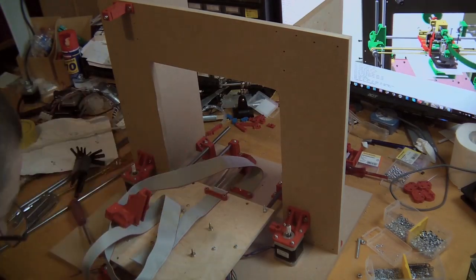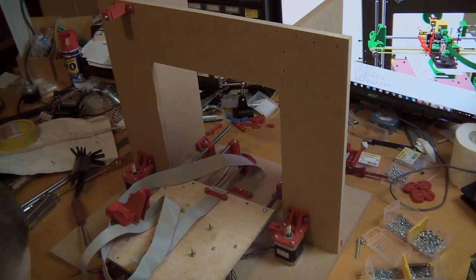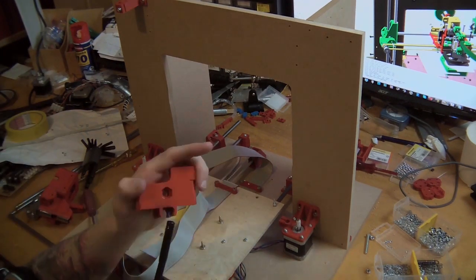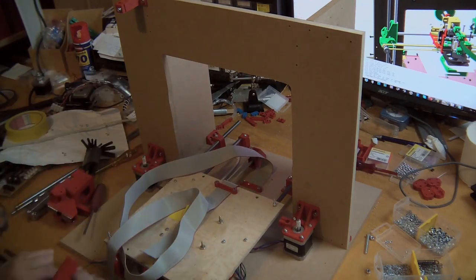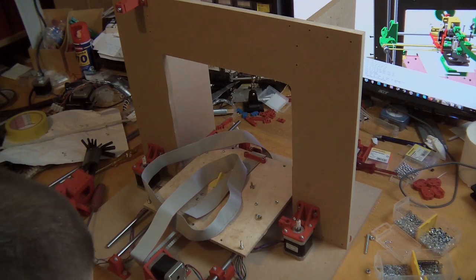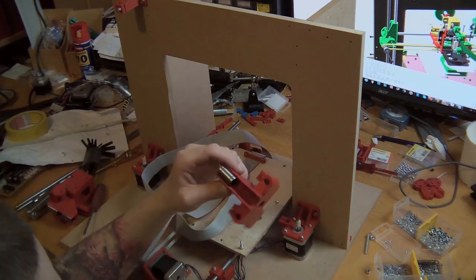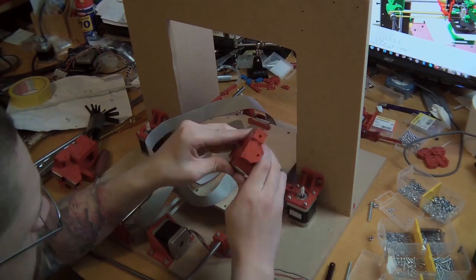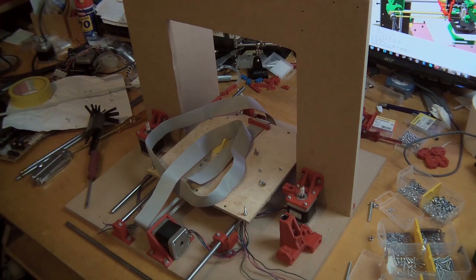As you can see here, the Z-axis is also screwed directly into the sheet. You actually get a drill guide with the printer. The drill guide is rendered specifically for your machine — there are easy-to-change config files where you can adjust screw sizes, printer size, and sheet material. Then it calculates the drill guides for you and generates a PDF you can print out, basically a poster of multiple A4 sheets.